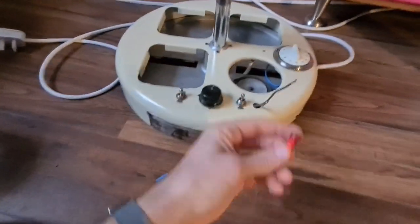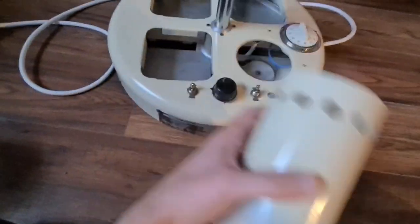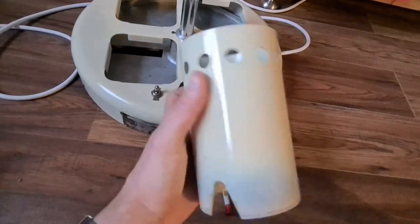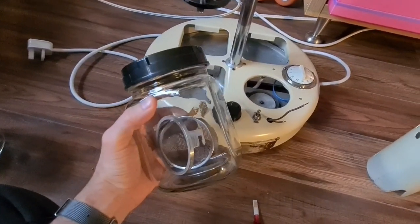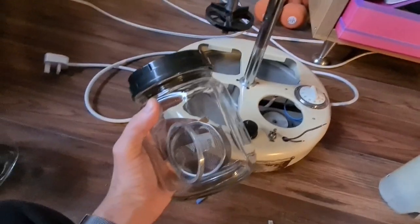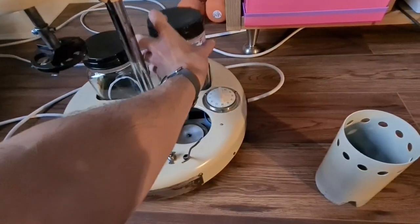Today I'm going to go solder the lamp in and heat-shrink over the connectors. I had to get a new 240-volt light off eBay — about £2.20 delivered — and that goes inside. I've covered all the terminals up properly and done a decent bit of wiring on it because all it takes is putting your hand there and you're getting straight 240 volts. The whole thing is 240, so a bit of safety really. I managed to kind of save the original plate on the front — covered in brown paint but it retains the name, motor, switch, slow/fast, and heater.